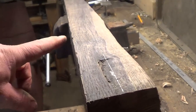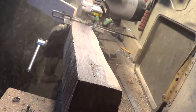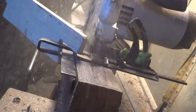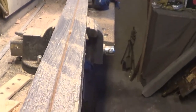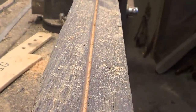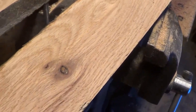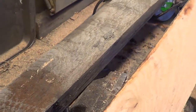This edge looks pretty straight — I'm hoping to get two handles out of it. I used a jig on my skill saw to make a nice even cut down the middle. I only went down about one inch at a time so the blade doesn't bind, just kept going over the same cut going a little deeper every single time. Now I have my two equal halves of really nice oak. I'm going to take my sander and sand off all this weathered wood — I think it'll be quicker than the planer.